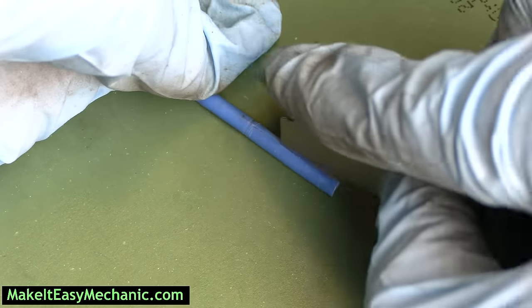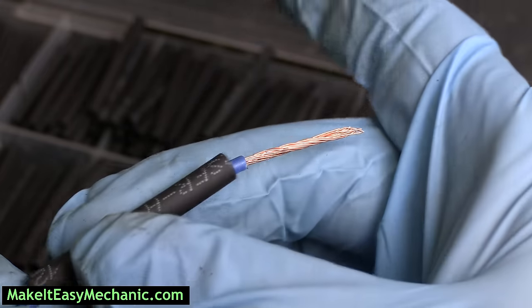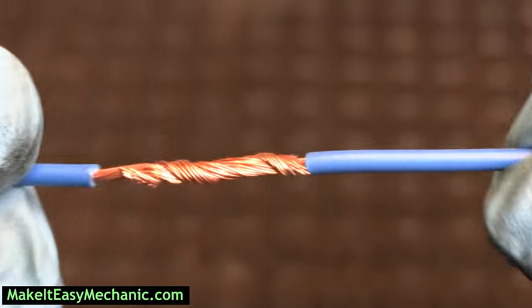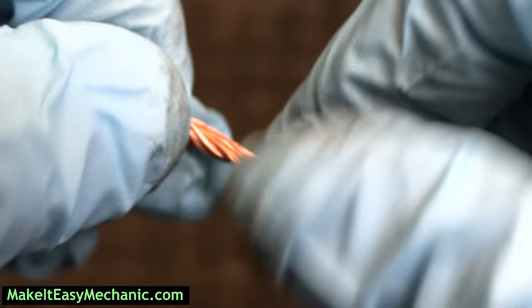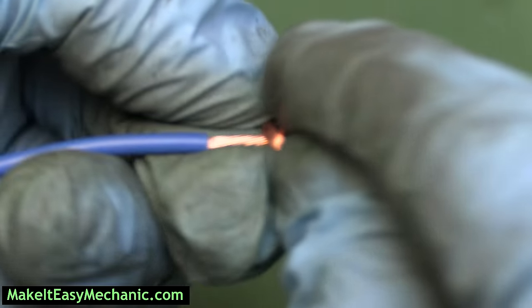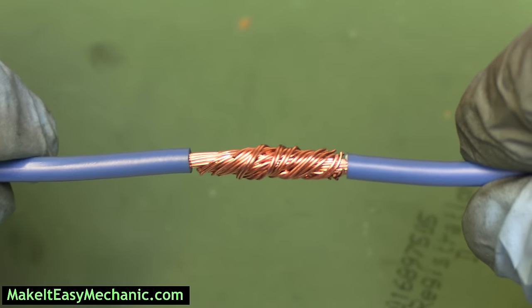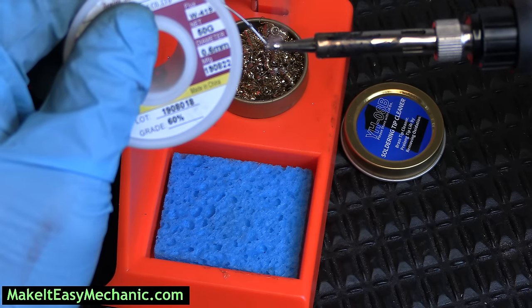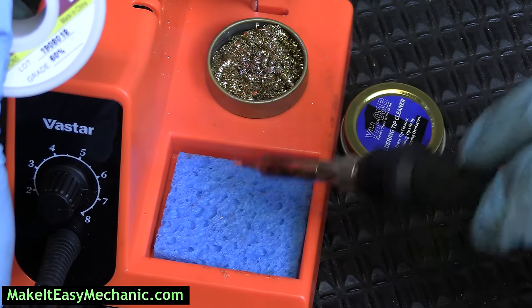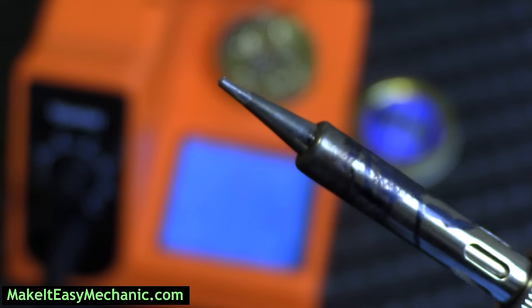Basic steps: first remove half to three-quarter inch of insulation, slide a shrink tube on one side and join the wires together. You can do it a couple of different ways. First option: fan out the strands, interweave and then twist them together. Second option: cross the wires and twist them away from each other. Both options work equally well. Watch out for wire strands sticking out because they can penetrate through a heat shrink tube. Next, heat up your soldering iron and tin the tip by letting solder melt on it and then wiping it off on a damp sponge to leave just a thin layer of solder. This helps with heat transfer and protects the tip from oxidation.